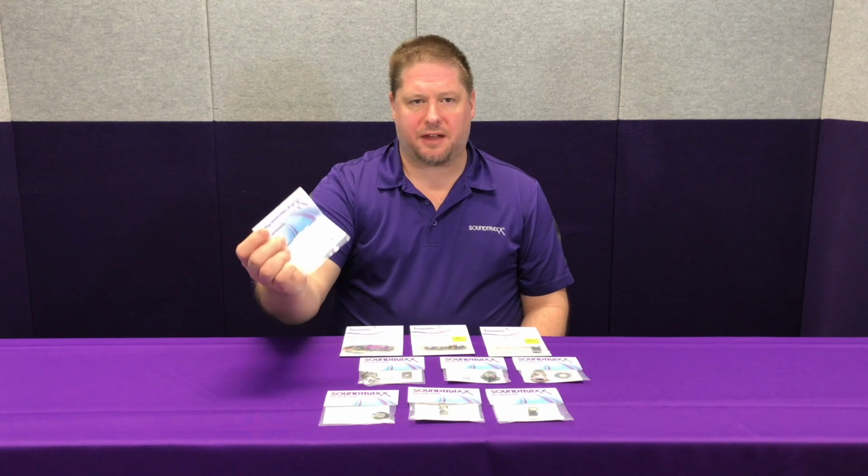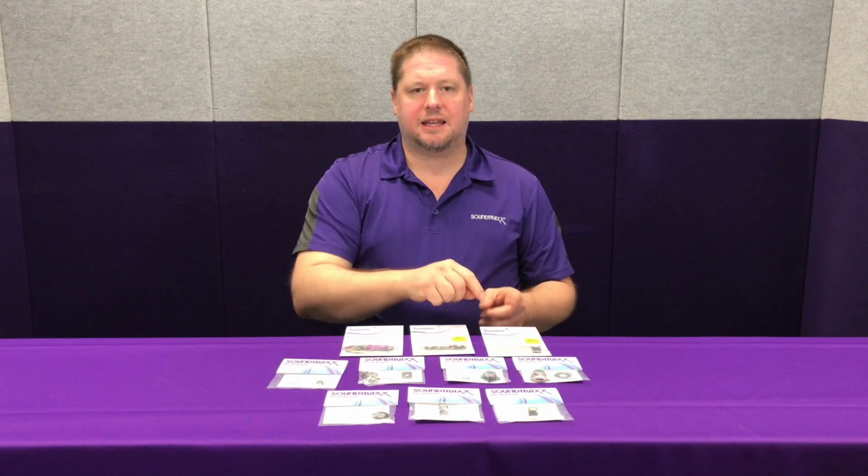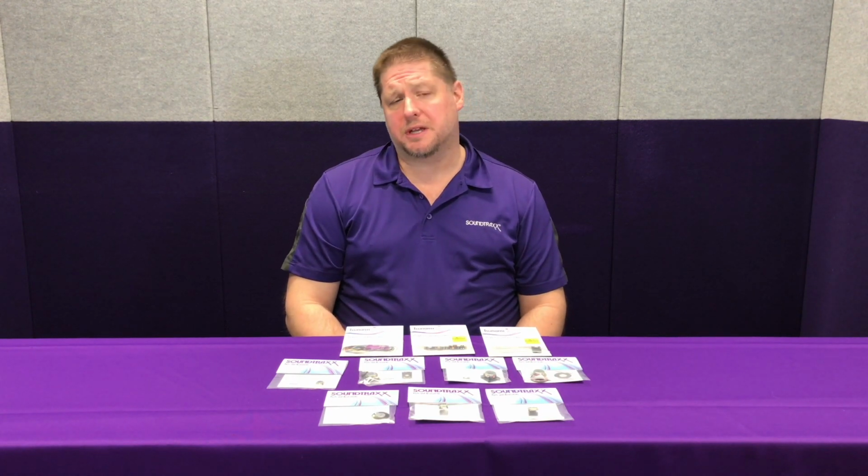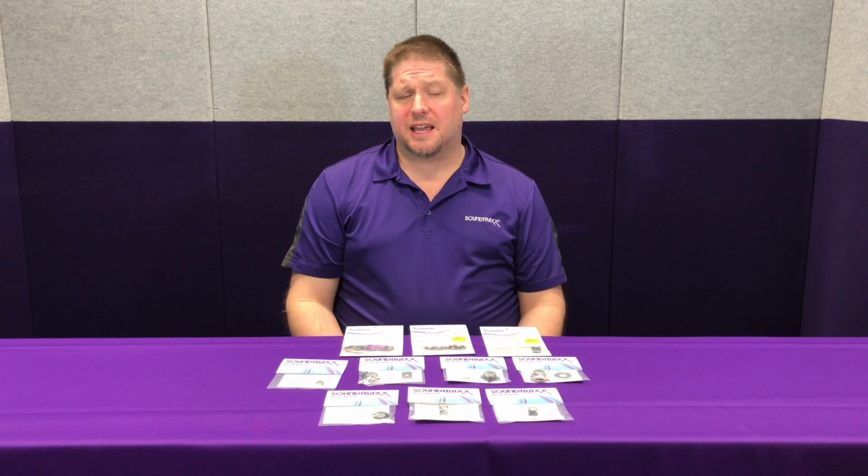That means we can't take our 1/2 watt speaker here, this 1/2-inch round, and tie it in and then crank the volume up, because what's going to happen is you're going to overdrive the speaker and potentially damage the voice coil and/or the diaphragm, and then what'll result is damage to the decoder, because if the voice coil is damaged, it can create a direct short, which then of course overloads and damages the amplifier. So you really want to make sure to take care that you have the proper power rating in your speakers.